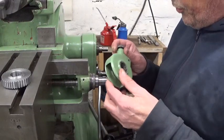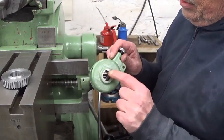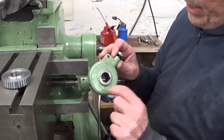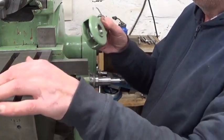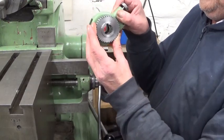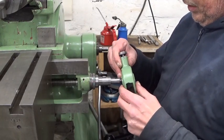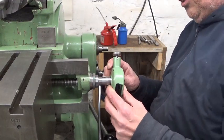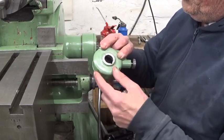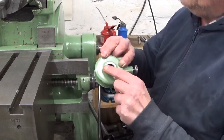Before I continue, maybe an important message to Chris and all Hamburg machine owners. In this system you see that the key slot, the other side too, and this part is cracked. What's important when you take it apart is that the gear that's inside is aligned, slot over slot in line, otherwise you cannot take it apart because of course this little key is in here. So if it's not aligned, maybe you want to take a hammer or a crowbar or something, and then this happens. Don't worry, it was not me. When I took it apart I saw that it was cracked and there is paint in the crack, so this dates from before the 90s somewhere.